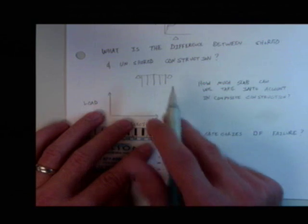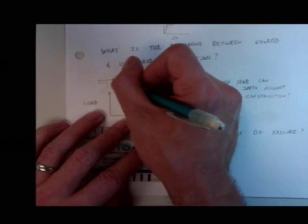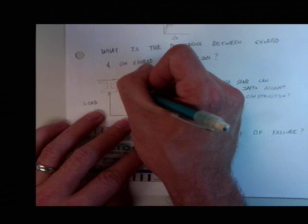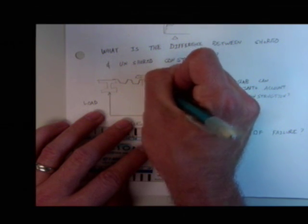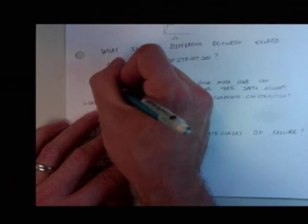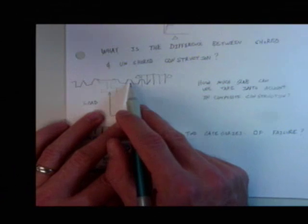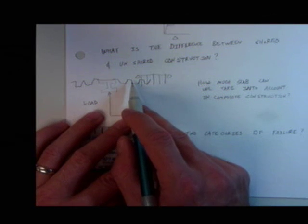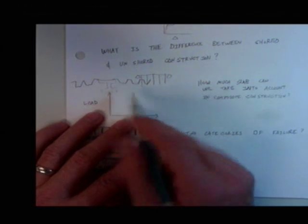Okay. It's not necessarily just right on top of the beam. If we looked at the beam going out in both directions, there could be forming. Oftentimes they use these things called pre-manufactured metal deck forms. Okay, it looks something like this. Okay, and like this. And in buildings, it's common to use lightweight concrete on top of that. It's better for fire protection. It's also lighter and keeps your loads down. It's also easier to pump. Okay, lots of things like that. So these are the forms.